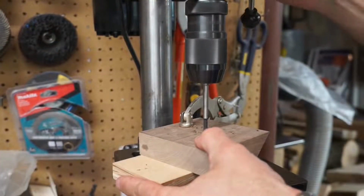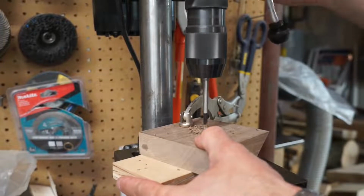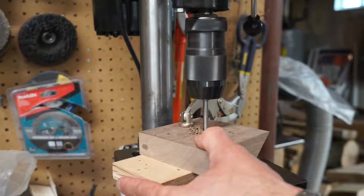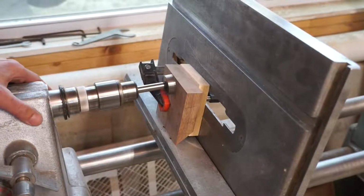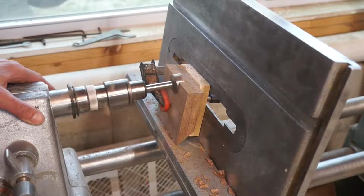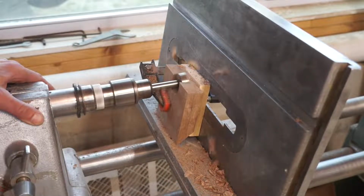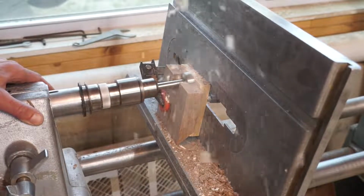With the remaining piece of walnut, I drill a 1/4 inch hole 1 3/4 inches down from the non-mitered side of the wood and center it. In front of the hole I just drilled, I bring it over to the drill press and at a slight angle take a 1.5 inch Forstner bit and make a hole. These 2 holes will be used to cradle the Coravin device.